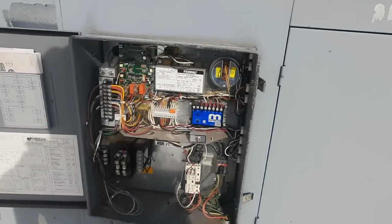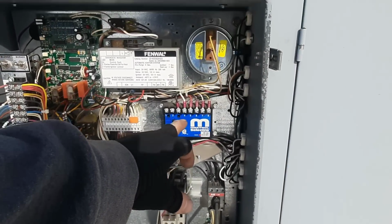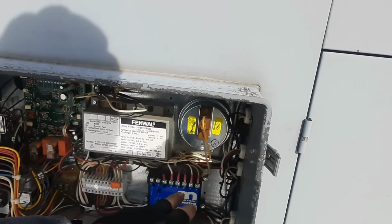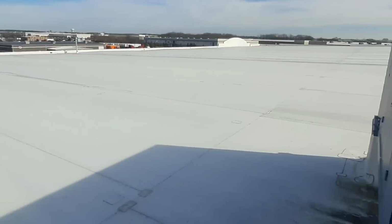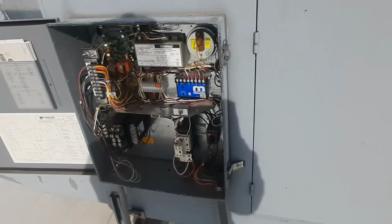Should be able to pull. I had to do some research again. I think it's 3 and 8 or 6 and 8 maybe. You pull the wire and it goes to low fire. You pull the other wire, it goes to high fire. So we can do that as well. Make sure the burner modulates that way. At least goes to low fire. Turn the burner back off.